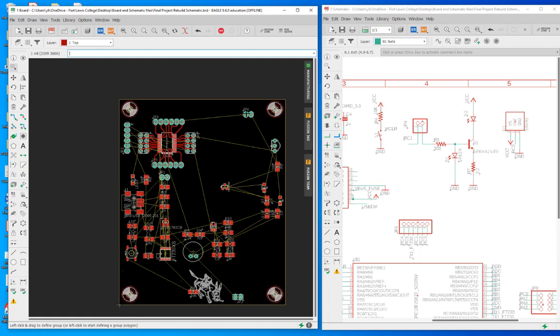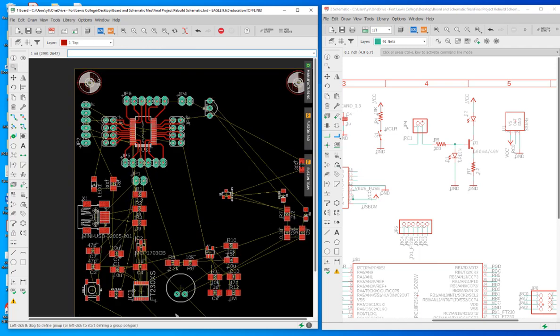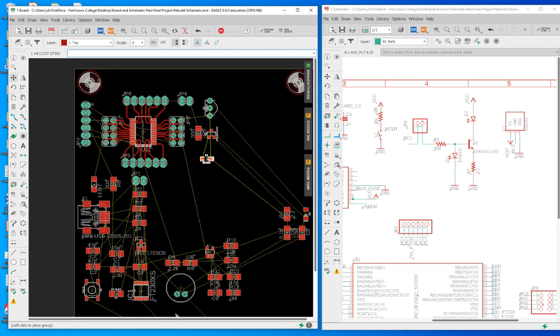So first, this is the jumper you want to use. This is the IR receiver. Place it here. Makes a lot of sense. And this is the resistor R5. I believe it's a resistor connecting to the base of this guy. You can see, place it over here, so it's able to make a connection directly. And you got an LED, which is the power indicator, not that important. Place it here. It's making an easy connection here and here.